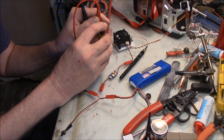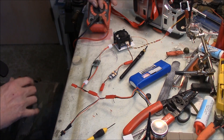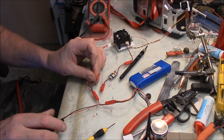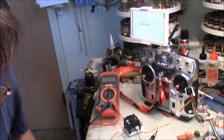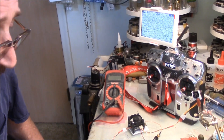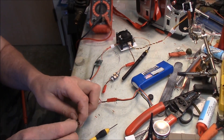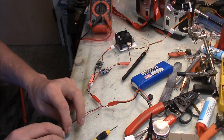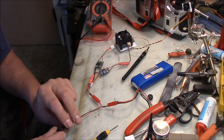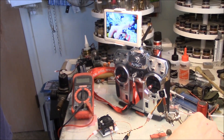You don't need to be exact — if you're within 0.01 or 0.05 that's fine. I've got 4.98, now 5.1 volts — that's going to be fine for my fan. And because of the way I have it wired, I've still got a solid 12 volts going to my transmitter. I'm going to plug in the power wire to my transmitter and turn everything on: the fan comes on, and the screen starts showing the picture from the FPV camera. As I move the camera around, it moves on the screen.